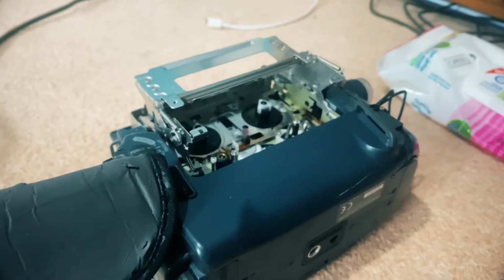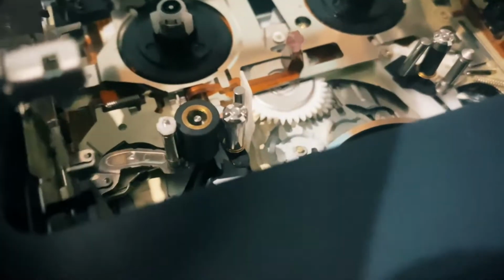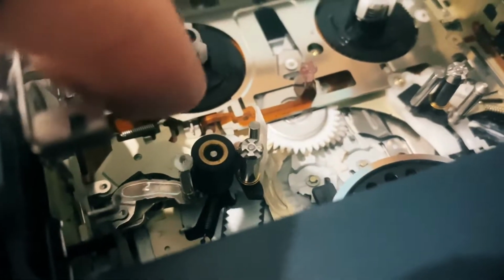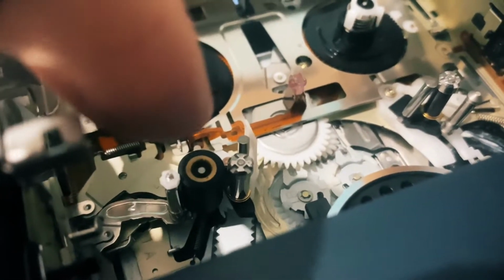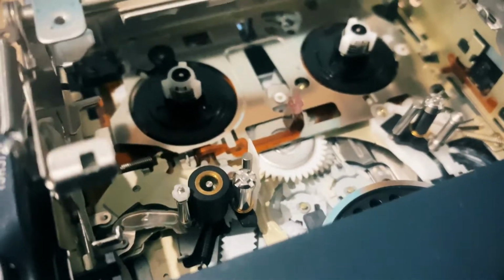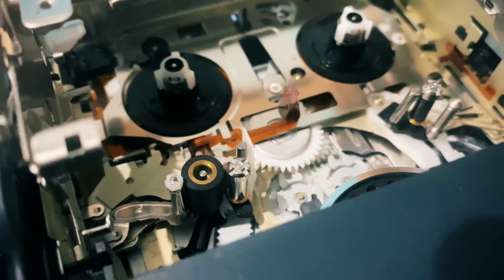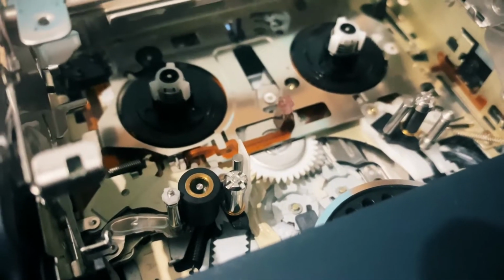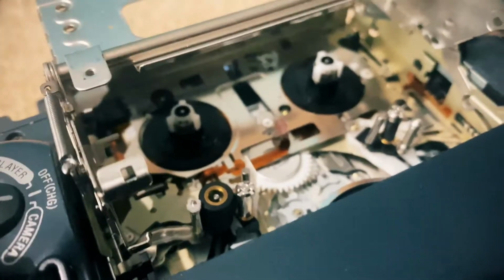And this one, the roller was loose inside, it was rattling. I was worried it's the roller there, the black roller here, which the reason it's loose is because the pins come out. I luckily have a spare, or quite close to a spare. If it's not going to work with that, I can do one with a Bic pen, just by cutting something off the end of the bit of plastic to hold it in place. But I have done a recording with it since taking it off and putting it back on. So I've just got to see if I can fix it with a pin. But if that goes well, that's two Digital 8 cameras.